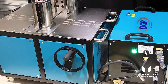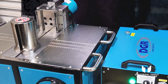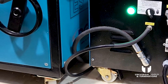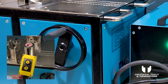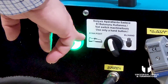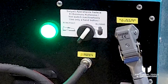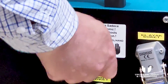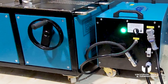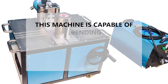The ES125 is powered by a 240-volt hydraulic pump. It is connected with a control cable from machine to pump. With this machine comes a foot switch or a hand switch, which is altered like a plug — if you're using the foot switch, put it in foot switch mode; if you're using the hand switch, select over to the hand position. It also comes with a circuit breaker for protection of the circuitry inside the pump.